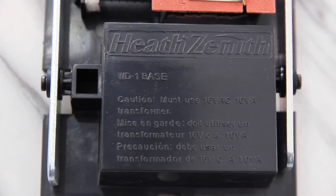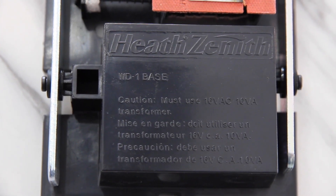If you're replacing or upgrading an existing transformer and still planning on using your chime, make sure the chime has the same voltage rating as the new transformer. If you put in a higher voltage-rated transformer with a lower-rated chime, you can fry the chime. So if you have to upgrade your transformer, you may also have to upgrade your chime.